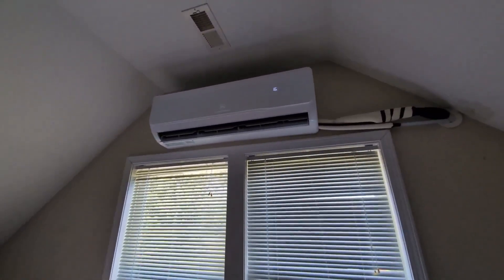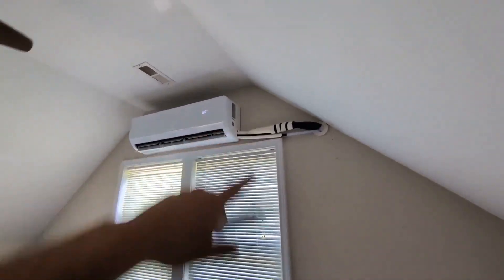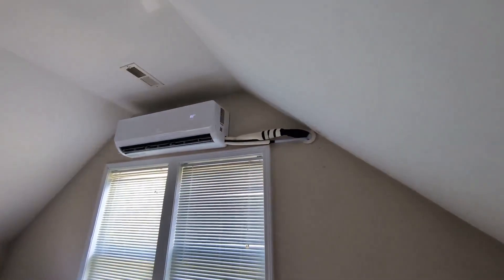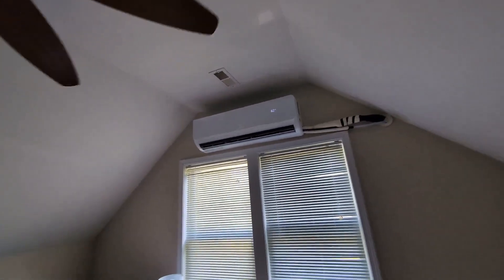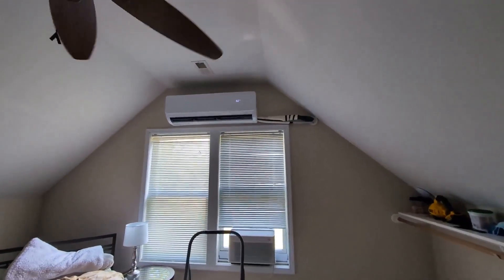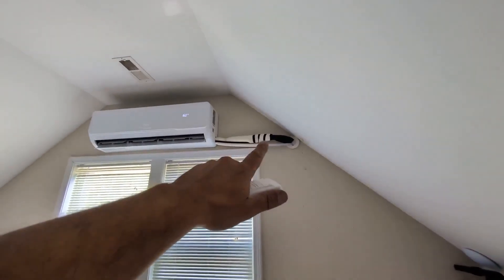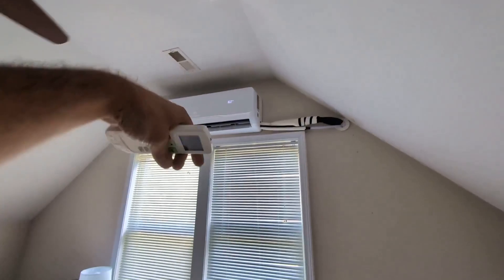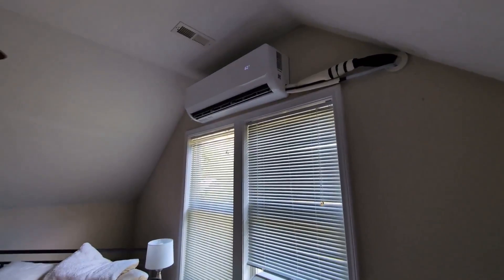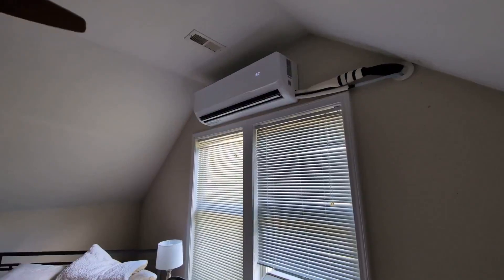It works. It's in, it's blowing really cold air, it's in a great location. Its ability to be in that location is dynamic because of the way that the line sets are set. Only one complaint — I wish those line sets were just a little longer. If you're doing this, make sure you understand that the line sets aren't suited for two-story height; they're more accommodating for a single-story building or first floor. In some rare cases you might be at the right height and able to go straight outside to the ground, but even then, if there's any elevation lift from the foundation, you're probably not going to be able to have your unit mount on the ground.